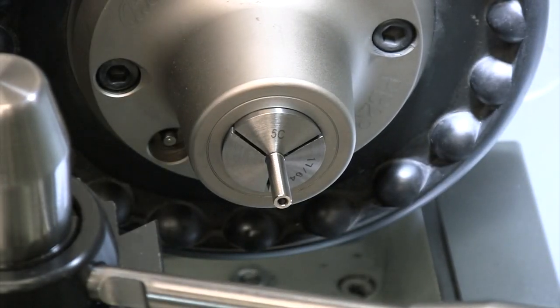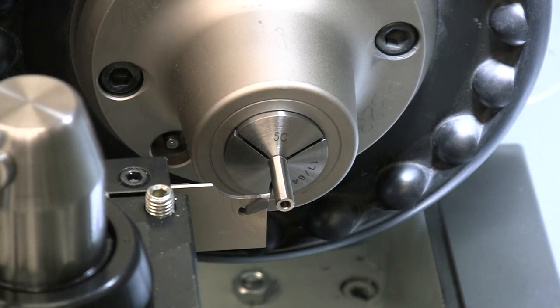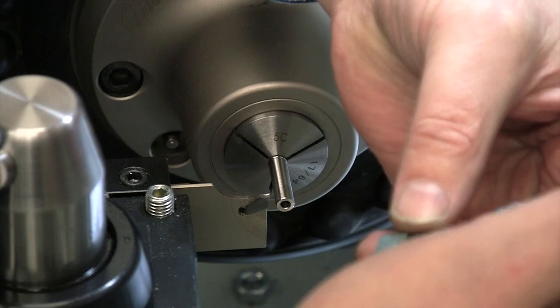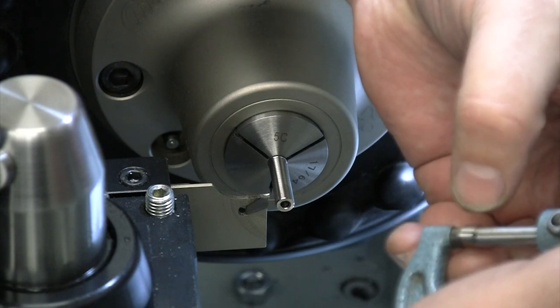These have a little bit of a chamfer as well. And let's see how we did on width on our other one. Make sure we got a good process here. Yeah, we are at 183. Going for 184. Then a thou, I would say we are good.